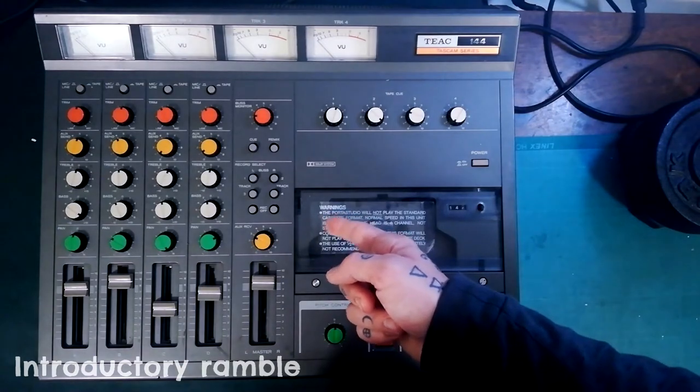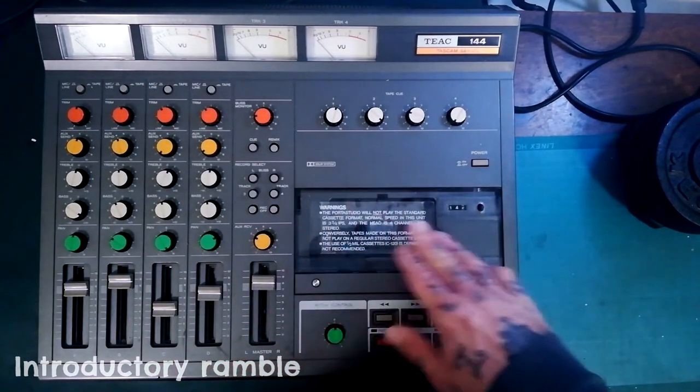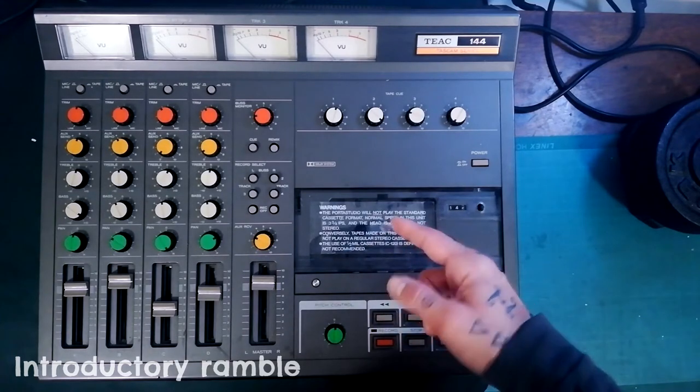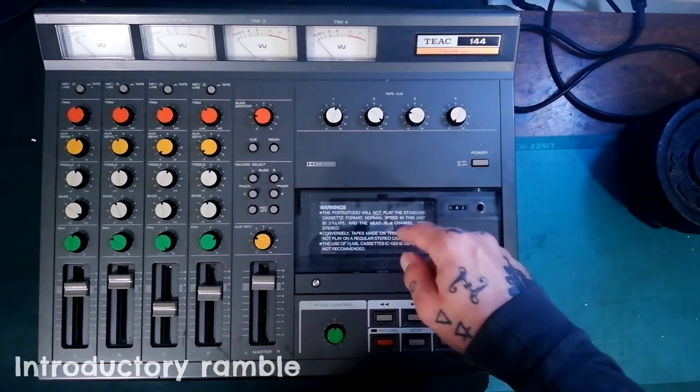The reel mechanism — the way the take-up and supply reel are turned, and playback, fast forward and rewind work — is way more complex, with way more moving parts and more things to wear down or go gooey than on subsequent designs. They realized they'd over-engineered it and simplified later designs. This unit is on loan to me; apparently it's crackly but still works — it's just squeaky. Squeaking implies the idler tires are becoming hard.